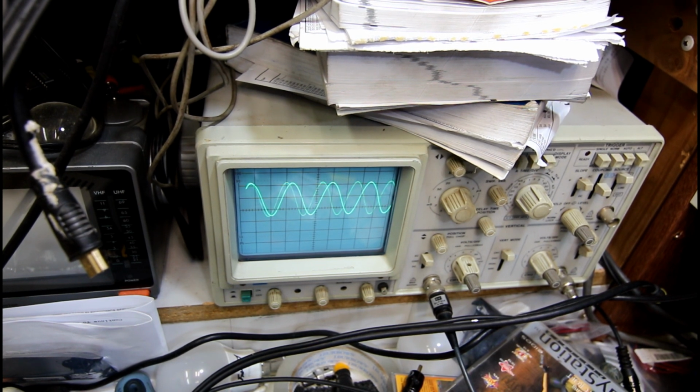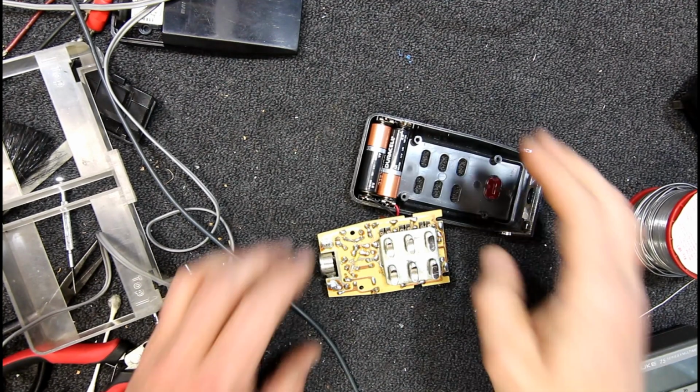So there's basically some sort of tuned circuit at the other end, and depending what frequency it tells, I guess, the microprocessor or whatever it uses. Not sure if I had a micro on these TVs or just some sort of 4000 series chips or something. To look it up, but depending on what the frequency is, that will trigger whatever function. Something will switch in there to up the volume, down the volume, turn the volume off, or change the channel, or turn the power relay on and off. Yeah, it's an interesting bit of old technology.